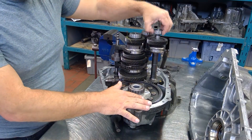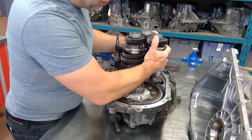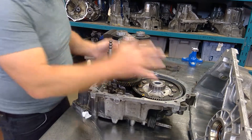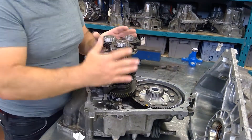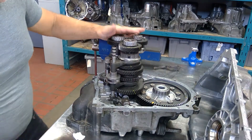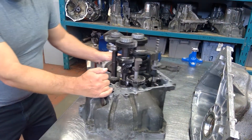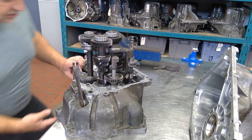As you'll notice, the shafts are using tapered roller bearings — there's a tapered roller bearing on each end of each shaft. You can also see how the shafts are arranged in a triangle formation, not in a line like in a diagram. These gears at the top are meshed to each other, so here's our input cluster where power comes in.